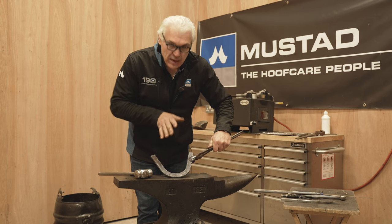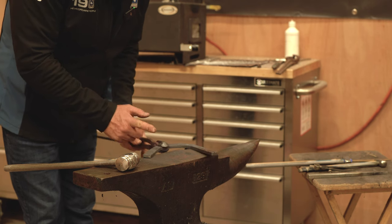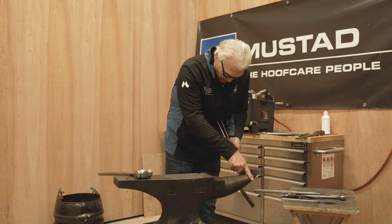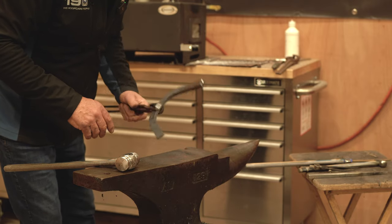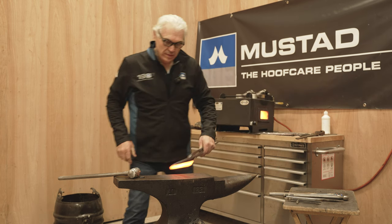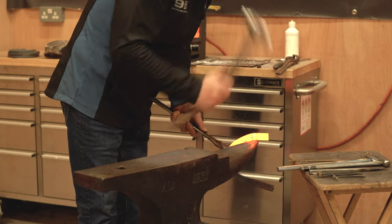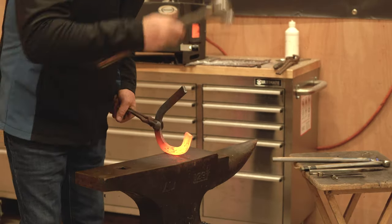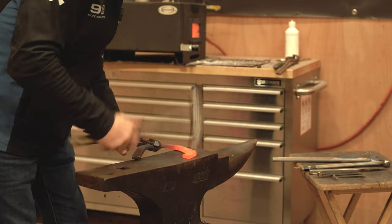We've had a bumping heat and a bending heat — fairly efficient. Now I'm going to bend my hockey stick. I'll put it on the anvil at the two-inch point and bend it to about 45 degrees — 45 degrees is fairly good for a heel bend, for a bar bend. Then I'll stack it back into itself. I hold it in line where my bar is going to go. My hammer blow travels the same distance each time — it's my tongs that make the difference. I drive into it, pushing into the corner and driving it back about a third up the corner.